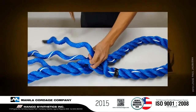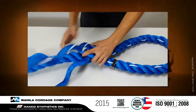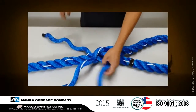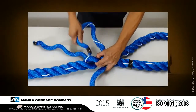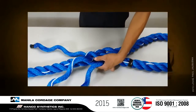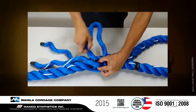For the third tuck, raise the last strand of the standing part of the rope and insert the last working strand under it. When pulling the strands, it is good to try to maintain the same pressure to keep the splice balanced. Repeat the same procedure to make 3 more tucks. 3 tucks are considered sufficient for natural fiber ropes, but for synthetic ropes, a 4th and 5th tuck is recommended.